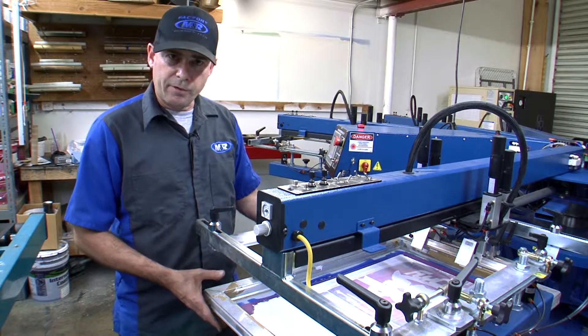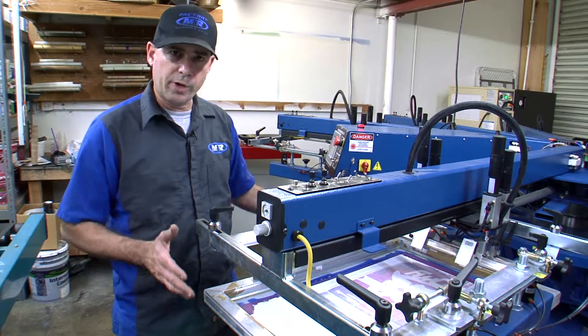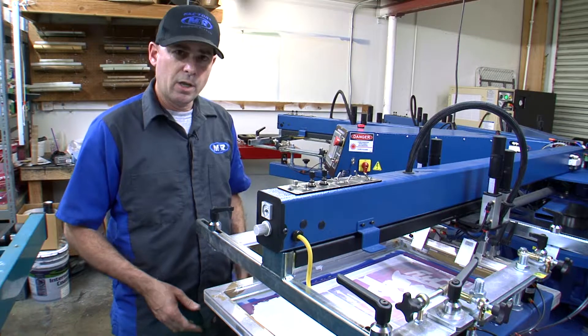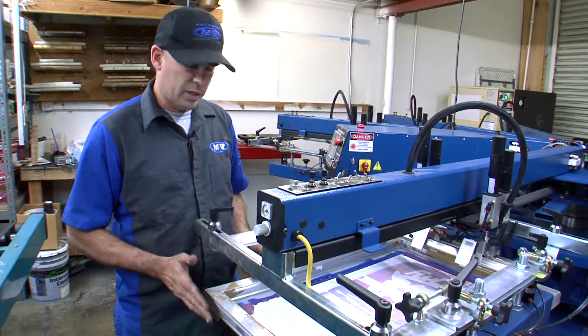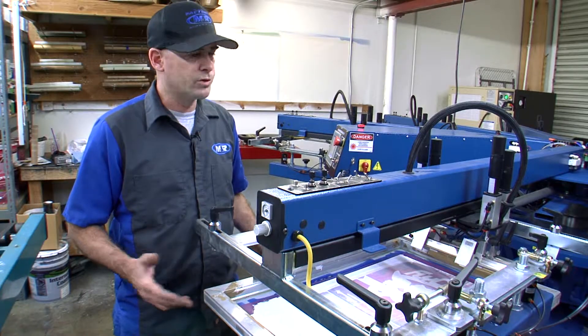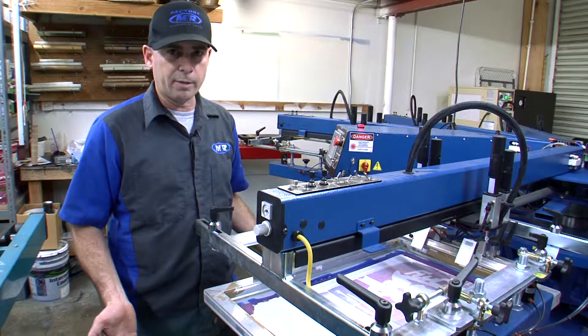You can do this for the side frame holders on diamond back presses or the front and rear frame holders on our other models. Don't exceed half a turn of pressure — the frame isn't going anywhere. Any more pressure than a half a turn will simply lead to the deformation of these frame holders and breakage.